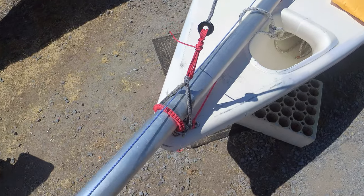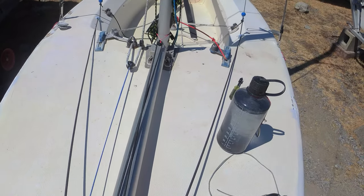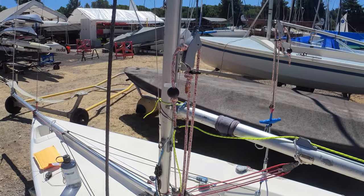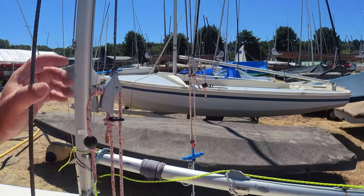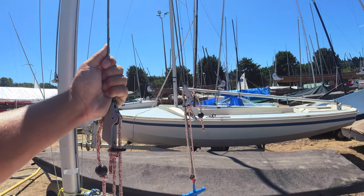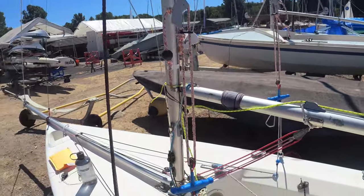Here's the final setup - this is temporary so it doesn't matter that this is caught. Everything is free to run freely and that is how it all works. Up here on the bow I'll give you a rundown of my trapeze setup as well because I really like it and haven't seen many people do it this way. I've gone to Dyneema for everything - I like that everything's soft, and especially for the trapeze, if I'm under the boat and get wrapped in it, it's very easy to cut.